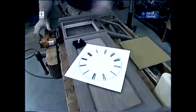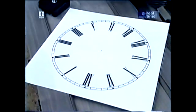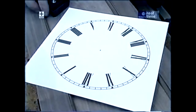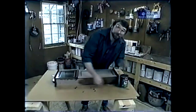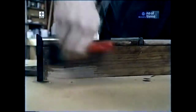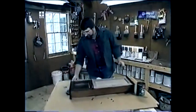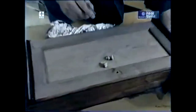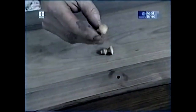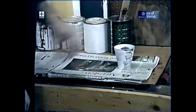These three little cleats will hold a piece of plywood, which in turn holds the clockworks and the clockface. But I don't want to install those now — I want to put the finish on first. For a finish on my piece, I've chosen a Danish oil, and to make it a little richer and darker I've added a little bit of Danish walnut stain. I'm going to put it on with a brush, let it sit for a while, and wipe it down with a rag. Five or six coats later, it should look just about right. My knobs for the clock are actually made out of maple — I couldn't get walnut ones — and stain won't penetrate deeply enough just rubbing it on. So I'm going to place them in a cup of stain and let them sit for a few hours.